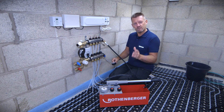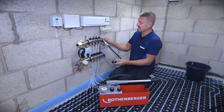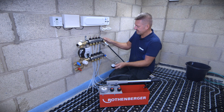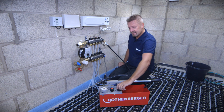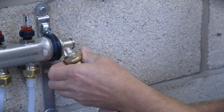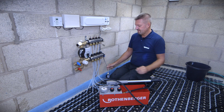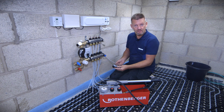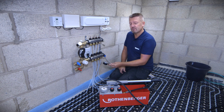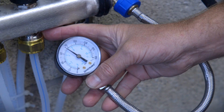Once you've got stabilization, all I would do is lock off the pressure tester — you've captured that pressure in your gauge — and then you can depressurize and remove the pressure tester from the installation. Check your pressure again and now we're going to give it a minimum of one hour pressure test. You shouldn't have any less than 0.2 of a bar drop in pressure from that minimum four bar, maximum six bar pressure test.